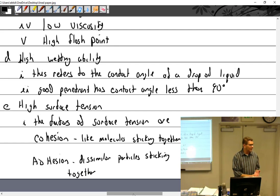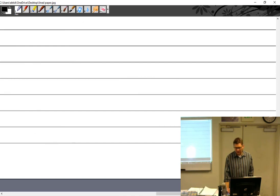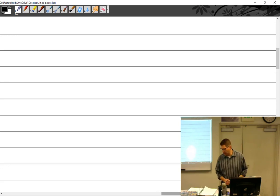I told you specifically, if you get it hot and dip it in there, then you kind of bake it on. Okay, so get it hot, but you've got to be careful with that flash point. So that's a bad thing. And for those of you that have done the penetrant, you know what I told you to do. Take it out and set it there. Don't leave it in. Get all the residual off. All right, and there's a reason why I did that. It's one of those things that is counterintuitive to what you would think actually works. So it actually works better to not do that.